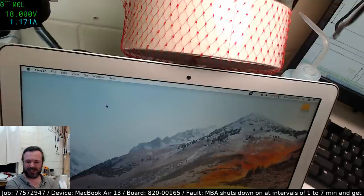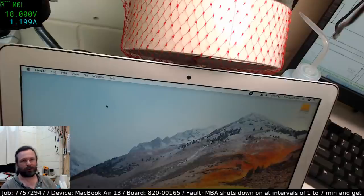And in the end, after we'd compartmentalized what we thought was the fault, we took the gamble and said, well, the easiest thing we can replace at this point, which could create these sort of problems, is the ISL chip. And we replaced the ISL chip. It failed the first time because I don't know, it was a dud ISL or I broke it or something. We put a new ISL on and it's worked ever since, so we seem to be good.